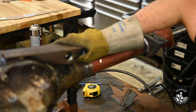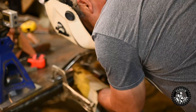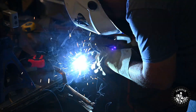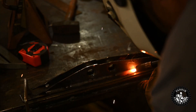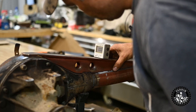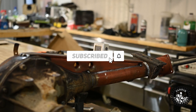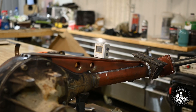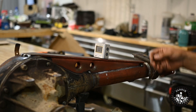That's a pretty good-looking truss - we just need to bend this tail down so that it can get welded up top. It fits real good and tight. I've left this side open so that any mud that gets in these holes you can wash it all out the end. If any water gets in behind there in the winter and decides to freeze, it won't expand and crack everything - it all has a place to run out.